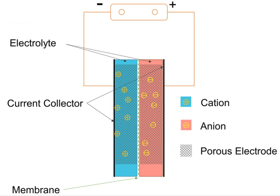Electrolytes. Electrolytes consist of a solvent and dissolved chemicals that dissociate into positive cations and negative anions, making the electrolyte electrically conductive. The more ions the electrolyte contains, the better its conductivity. In supercapacitors, electrolytes are the electrically conductive connection between the two electrodes. Additionally, in supercapacitors the electrolyte provides the molecules for the separating monolayer in the Helmholtz double layer and delivers the ions for pseudocapacitance. The electrolyte determines the capacitor's characteristics, its operating voltage, temperature range, ESR and capacitance.